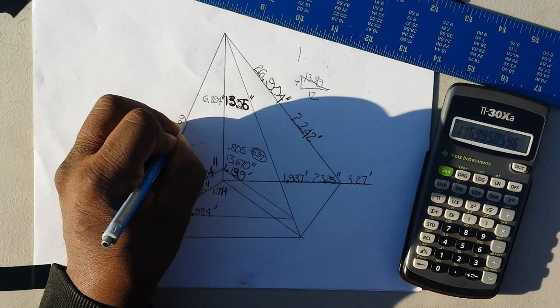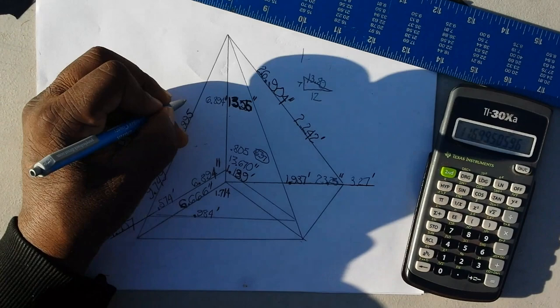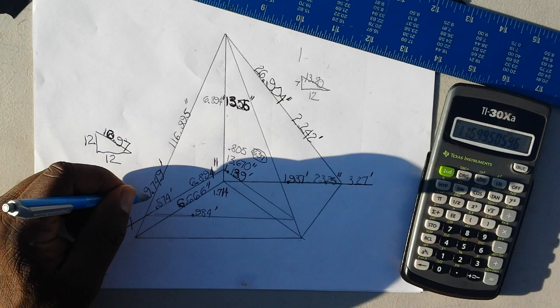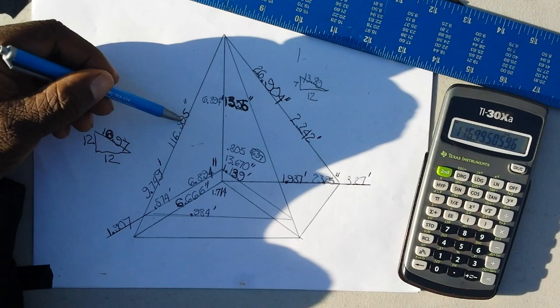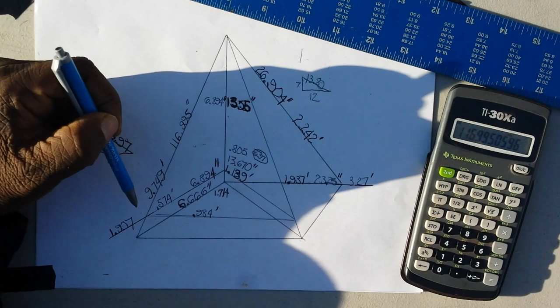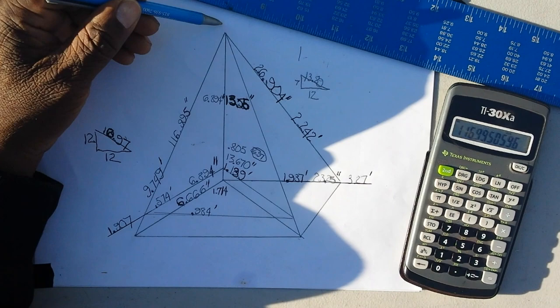We're just going to go three places, okay? And that's inches. So 9.749 feet is the same thing as 116.99, which is basically 117 inches. These are equal measurements, one is just in feet, one is in inches. Now that we figured out the rafter, we know what the run of the common rafter is for the 12-12 side. We know what the rise is for the 12-12 side for the buildup of the plates and everything.